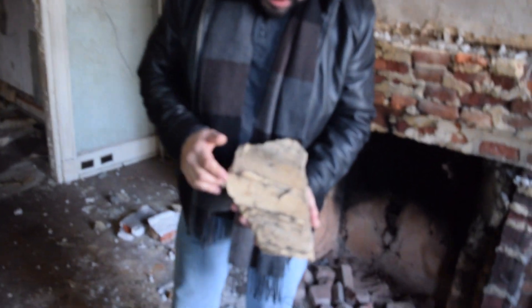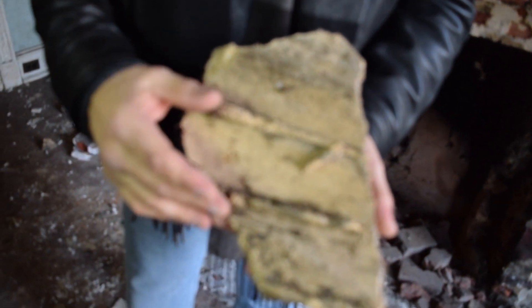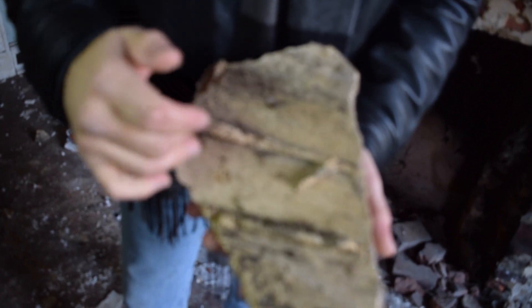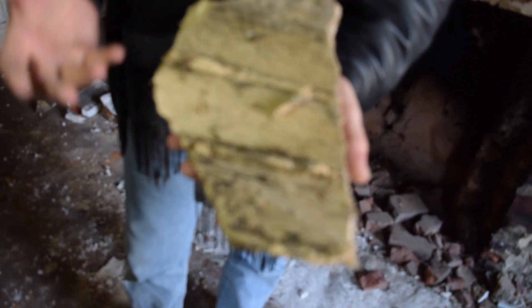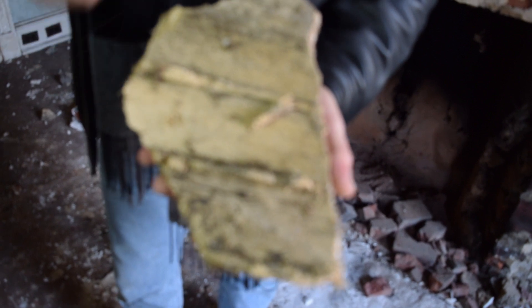Just take a look. These are the key ways — they go between the lath. The lath are the boards that actually hold the plaster to the wall. And interestingly enough, this is actual hair. Hair is the binder to give good tensile strength to the plaster when it wants to crack through the seasonal changes. The hair keeps it together.